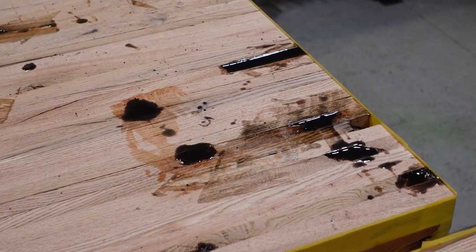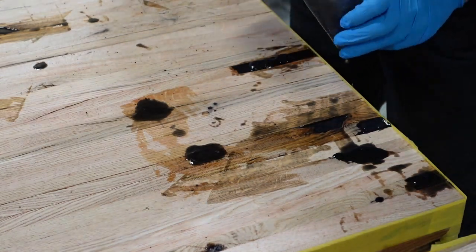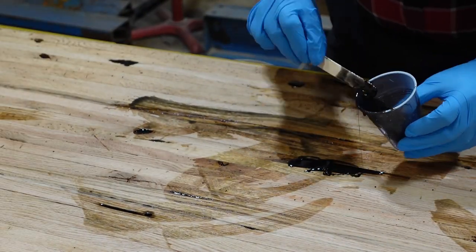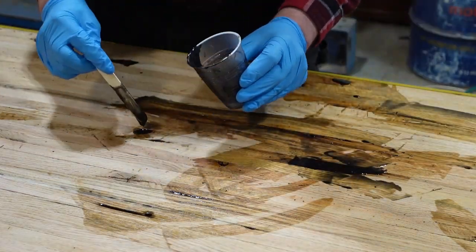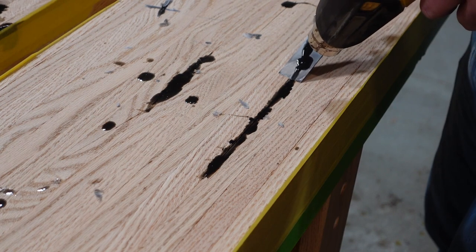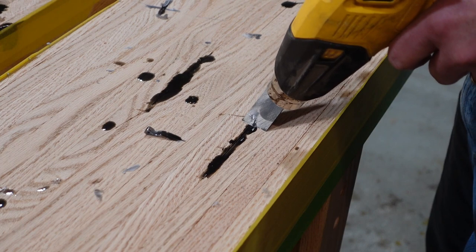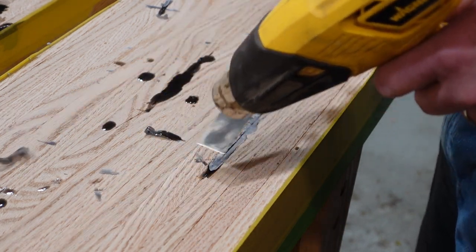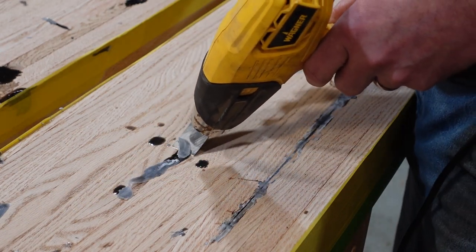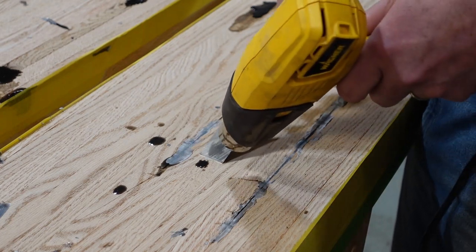Epoxy is not a quick process. It is actually worse than sanding, especially when you're filling in a lot of these little holes, and sometimes people make this look way too easy on YouTube — it takes patience and doing it over and over again. Here you can see I'm trying to get rid of some excess using a heat gun and a sharp chisel. That actually works very well. Big advantage to getting epoxy off that way rather than having to sand it completely off — I'll take that method any day. It just takes a little bit of practice to get the technique and the heat right.